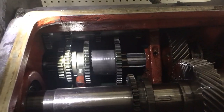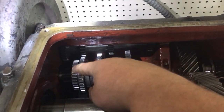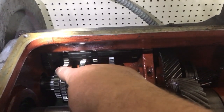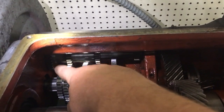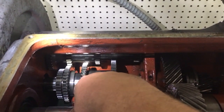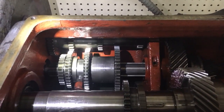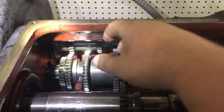My original intention was to braze the gap — fill it full with braze and then cut a profile with a tool bit and broach it. But being it's the high-speed gear, I don't know about that. There's going to be quite a bit of torque on it, especially when cutting, so I'm having second thoughts about that.